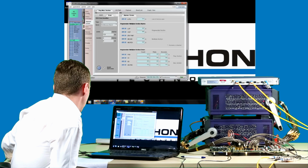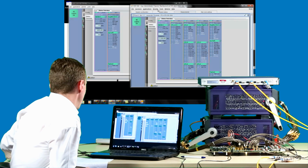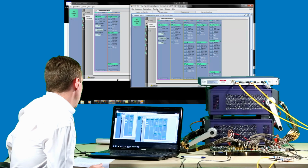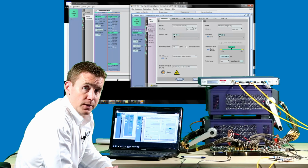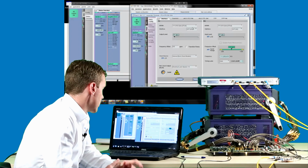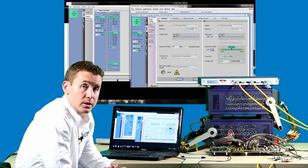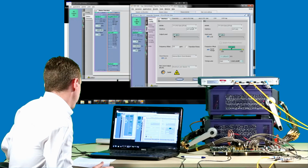So moving on to our test equipment. We'll be using our STM64 client tester and the 100 gig OTU4 tester. If we start from the OTU4 side and examine the physical interface, we can see that the bit rate is as expected, OTU4, and we have a small frequency offset. This is due to a slight difference between the transmit reference clock on the Virtex 7 card and the receive reference clock in the JDSU test equipment.